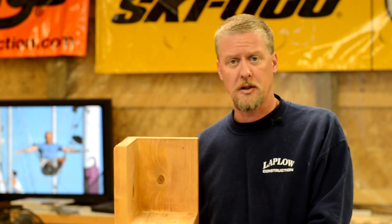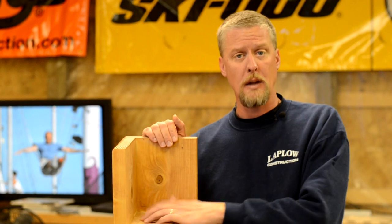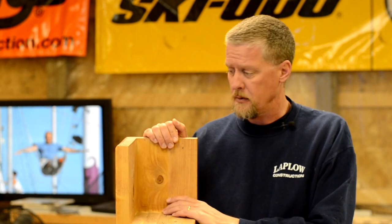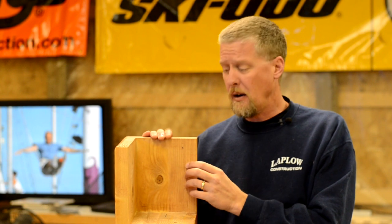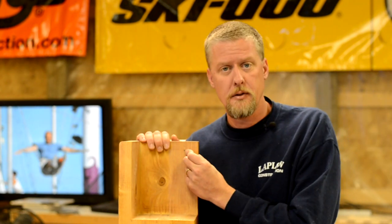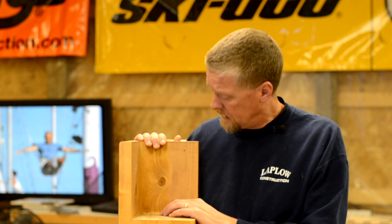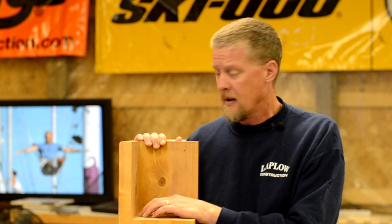When I originally designed this table, the legs were just going to be a hollow box, attached to the frame with a mortise and tenon joint with glue. But because I decided to do a full lamination and make things beefier, the legs just had to come off, and now they're going to be attached with screws. One thing that pine does not do very well is hold screws, and I'm very afraid that over time those screws are going to back out, making the table unstable. So what I decided to do is embed some hardwood where the screws are going to go, and I'm going to use doweling for this. I have some extra oak doweling, and the oak will hold screws much better than the pine will, so that should alleviate the issue.